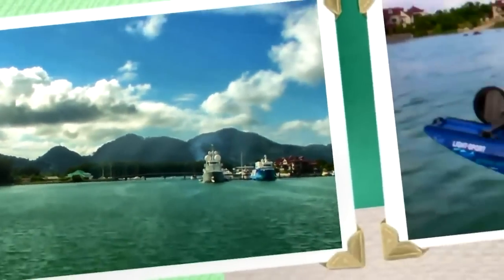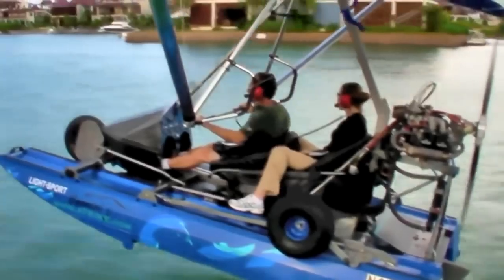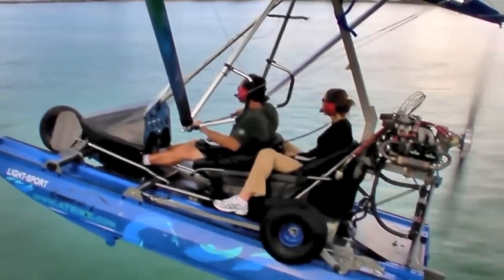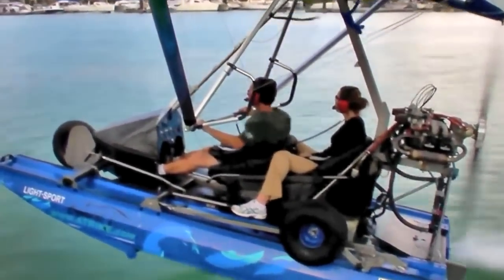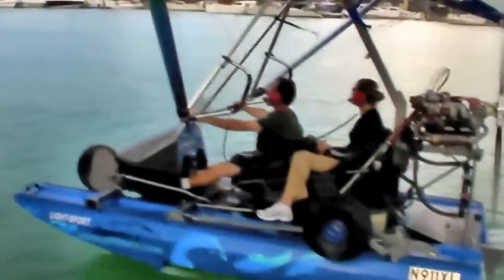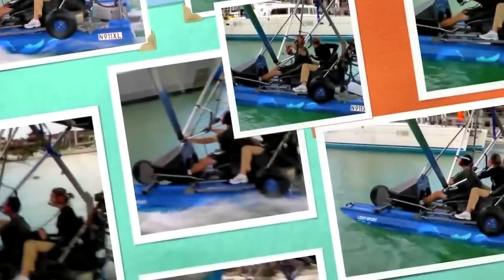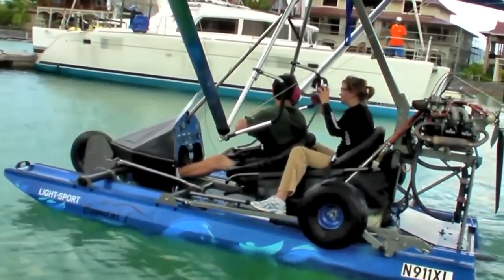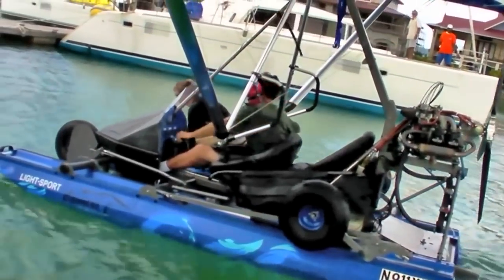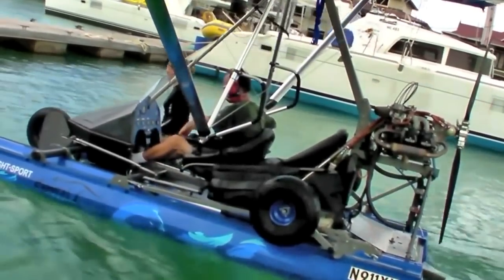For the GA pilot who's still unsure about flying this: these are instructor bars, and after a back-seat intro we put the student in front for lessons. In the back seat there's a switch box with mag switches, so the instructor can clearly operate everything from back here — with bars and pedals you can completely operate it from the rear. If the student goes 'I'm not sure what I'm doing,' the flight instructor can do everything from the back seat, including kill the engine with the kill switches and fly the wing as needed.